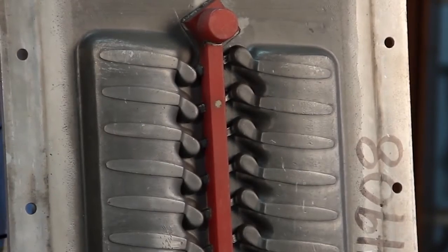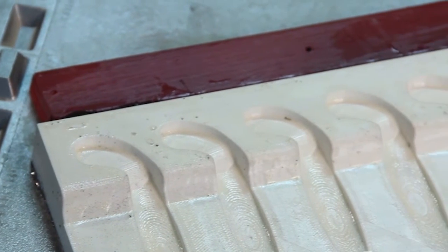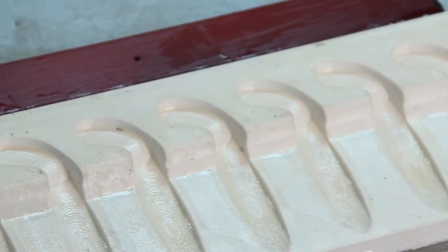The challenges with the traditional method were that you had longer lead times and you were pretty much set on what you had with your match plate because it was being machined out of aluminum, where with the plastic you're set but at a very low cost. We can then reprint something off, change our parting lines, change where we're putting gating in very effectively. With that particular project for the FBM, we saved about three thousand dollars per pattern as well as about two to three weeks of lead time on the actual production tooling.